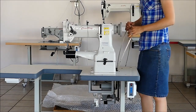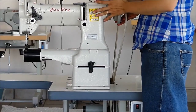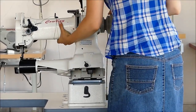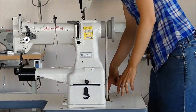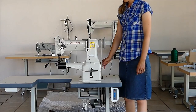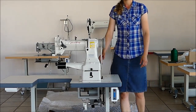The belt may be in the box or it may still be on the pulley. If the machine has a head that tilts back, undo this fastening here and tilt the head back. The belt just goes into this groove and pulley on the head. Down here in the speed reducer, there's also a groove for the belt to sit in. It should be all adjusted right from when we've tested it, but if something has moved in transit, the belt may not be tight and you'll need to adjust it at the speed reducer.